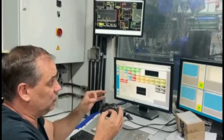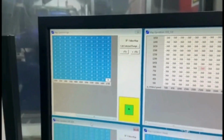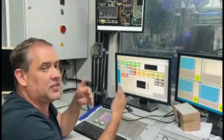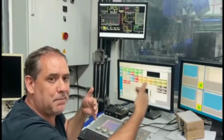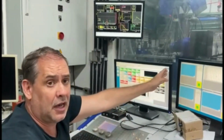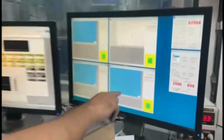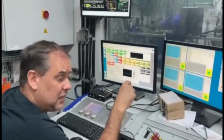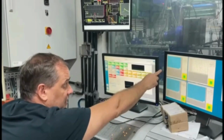And then, as soon as you do this, we need to compensate the ignition timing that you see here. You see, map operation ignition. So we increase the ignition time because when you lean the mixture, the combustion takes place in a slower mode. It decreases the speed that the flame propagates, right? And due to that, we need to compensate this in the ignition time parameter, okay? Simultaneously, we start decreasing the dwell time. This is the charge for controlling the energy to the coil, and then to the spark plug, right? And by means of this, we start decreasing this. So we lean the mixture, and simultaneously need to compensate this by the ignition time.